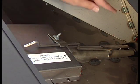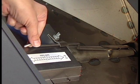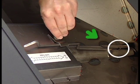Check the movement of the fuel adjustment rod located in the hopper. It should slide up and down after loosening the thumb screw at the top. If it doesn't, loosen or tighten the set screw at the bottom as needed.